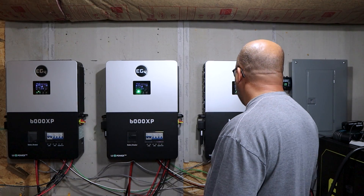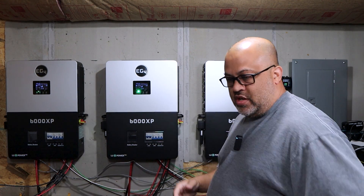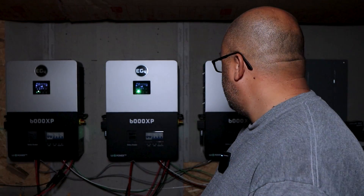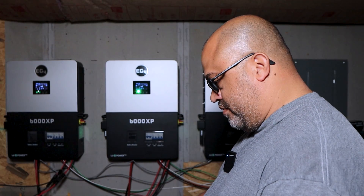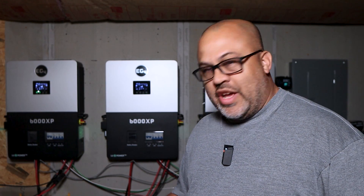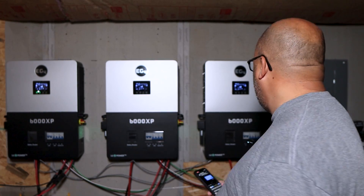I'm going to have them start the dryer. There must not be anything huge running — I do have my car running at 16 amps — but I'm going to have them start the dryer and let's see what happens. Right now we're running at 30%, 29%, 28%, and 30%. We'll see once they get the dryer started. We tried to start the dryer and as you can see, it knocked out all the power. So I guess it was too much of a load.